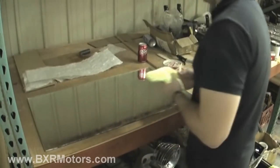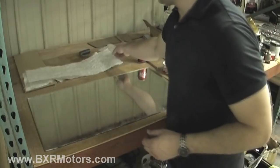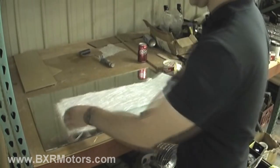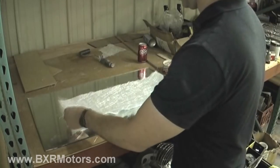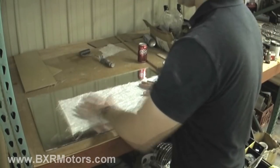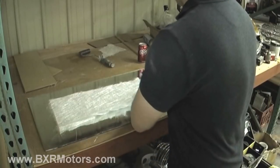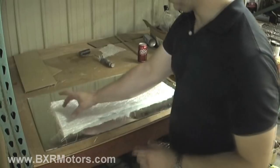So what we do is take some sheets of fiberglass and lay them on top of the glass. I'm going with two 1.5-ounce sheets of fiberglass layers — they're not cut very straight but that's pretty much okay. I'm only going to need just a little strip.